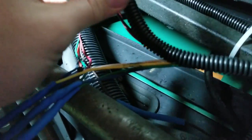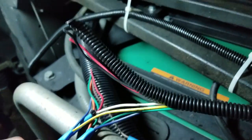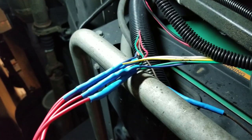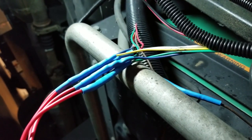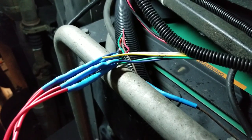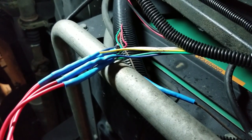The wire colors are a little bit different, but not a big deal. I had some extra ones that I didn't use — I may use them in the future. Right now there's something with the switch where I have to manually sync it. If the AGS is set to automatic and you then turn it on with the switch that came installed with the motorhome, it gives you kind of an error and gets out of sync. Basically the AGS thinks it's off but the generator is actually running. It's not really a big deal — you can just turn it off again manually and then it's all good again.